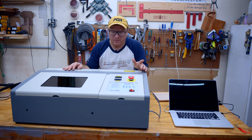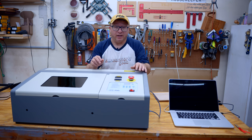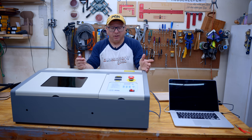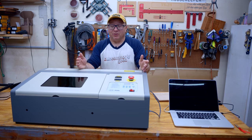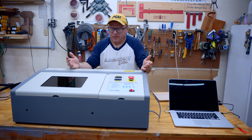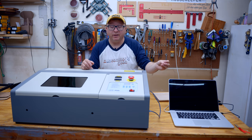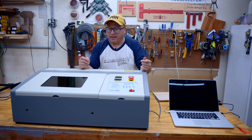So I did follow the process to align the lasers — it took me about three or four hours. It was not hard, just very repetitive and tedious. The manual says to take double-sided tape, stick it on the mirror, hit the test burn and allow the beam to hit the tape to see whether it's centered. What I found is that it actually causes the tape to stick to the mirror, so when you're done you have mirrors gooped up with tape. I basically took out all the mirrors, cleaned them very well, and followed a technique from an online video — creating a little ball behind the tape so it doesn't burn through and hit the mirror. That seemed to work better.